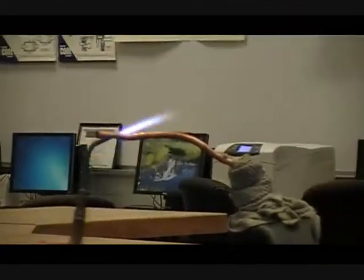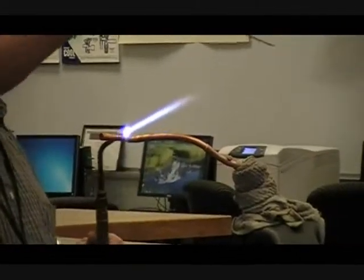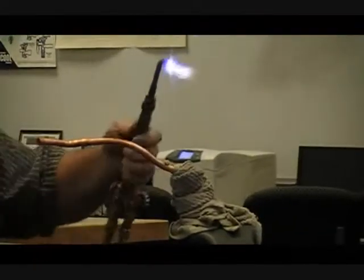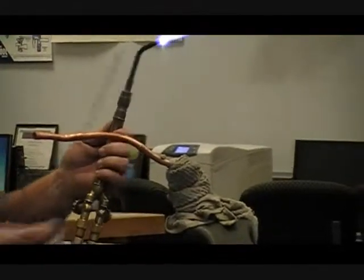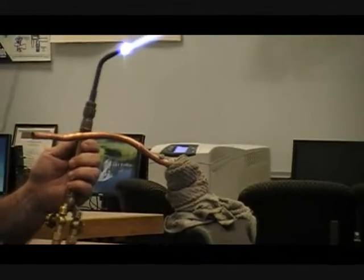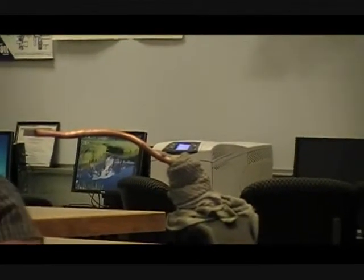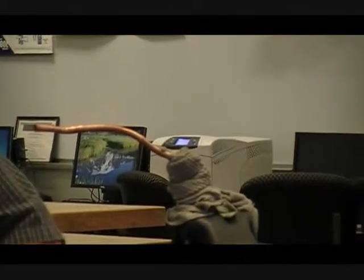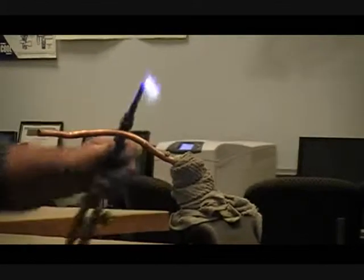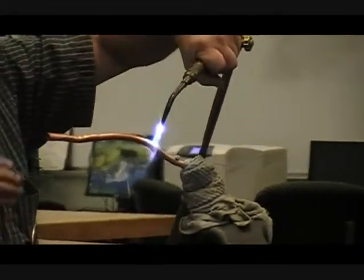Let's say I'm in a situation where I've got an electrical panel on the backside. I've talked about how far this torch tip really reaches — I don't want to go over there and melt a bunch of wires. I need to do some protection back there, but I still don't want to depend entirely on my protection plate to handle the heat. So let's modify our approach with the rod and keep the heat away from that panel.